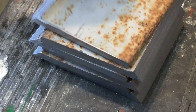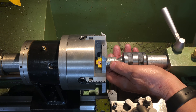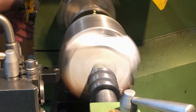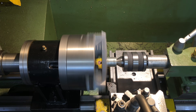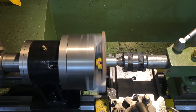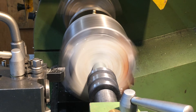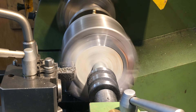The next bit was to remove the lip off this material. I elected to use the lathe for this operation because I can hold it in the four-jaw chuck, and to be sure of holding it in four places rather than using the mill and only holding it in three places. I need the material to be reasonably flat so that I can bolt them all together, which is probably going to raise a few eyebrows.